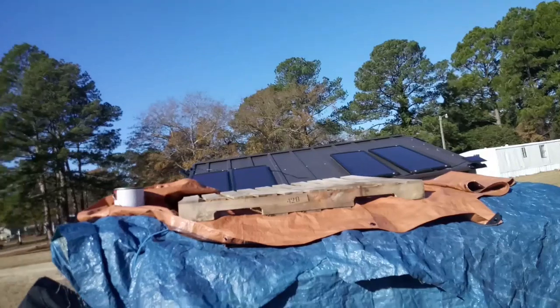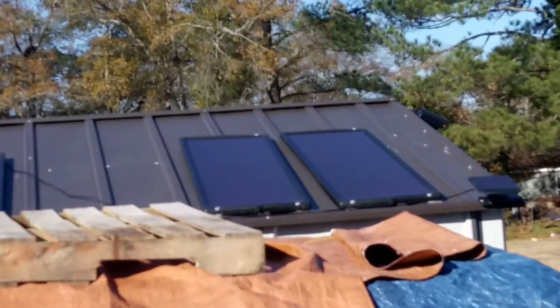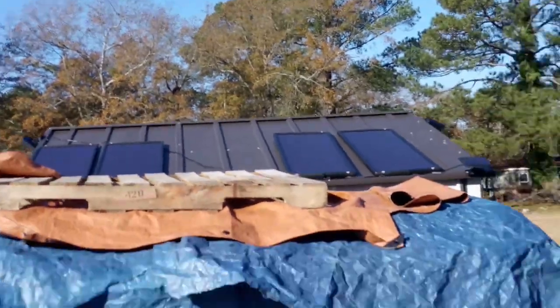To be more precise, this is not the solar panel kit itself — this is all the parts to the kit. The solar panels themselves, if you'll excuse the mess, are up here on the roof. There's two there, two there. They make a 100-watt solar panel kit, so each one is 25 watts a piece for a 100-watt solar system. I've also wired a spotlight in for behind the shed and a power source for behind the shed to the smaller inverter, which is also run to the batteries, so I have power sources behind the shed.